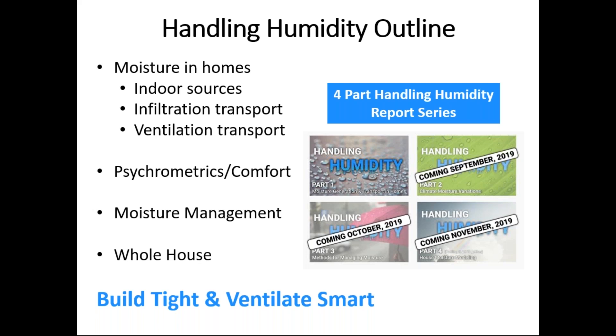The fourth and final report, to be released in November, looks at the whole house in perspective with the energy loads for a house in Florida versus Seattle or anywhere else. How important is it to seal a home? How important is it to manage ventilation carefully? What kind of moisture loads and resulting energy loads does that result in? This talk will touch on each of these four topics. And the end result is simply something many of you already know: build tight — seal it up as tight as is practically and economically possible. In some cases with renovation there may be limitations, but for new construction there really are no excuses for not building tight these days. And then ventilate smart — we'll discuss what smart ventilation consists of within this talk.